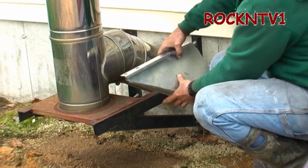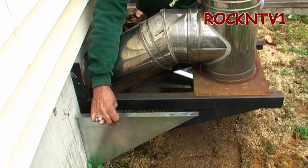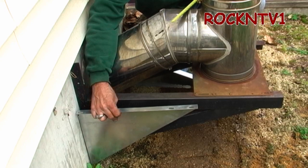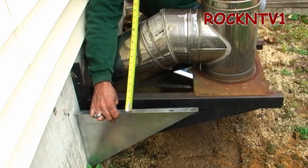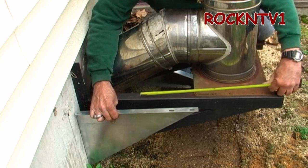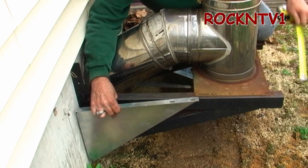This bracket goes against the concrete. You can notice the difference in size and ruggedness — this is like one-eighth to three-sixteenths bed frame steel. All that bed frame steel is not weak; try drilling a hole in it and see. The flue pipe would technically be in the center of that. That distance is going to be the 12 inches of my overhang on the roof plus the 2 inches away from my shingles, which is required. 2 inches away from any combustible materials all the way to the cap — about 14 inches from center. That's why I made these brackets.